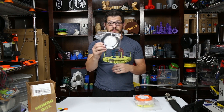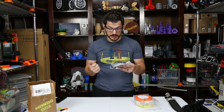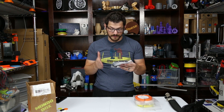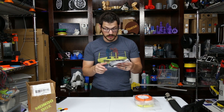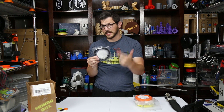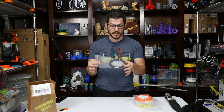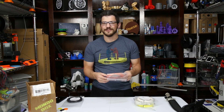First up we have 3D Mars Black PLA. I did review the 3D Mars White PLA if you want to check that out. This is a basic black PLA filament — prints smoothly with rich color consistent throughout the spool, can be used as everyday printing filament. Print specifications: PLA, print speed 30 to 100 mm/s, extrude temp 195 to 220, bed 60 to 90°C, non-abrasive. These are 20-meter spools and they have zip ties on them. I'm still not a big fan of those — twist ties are much better.